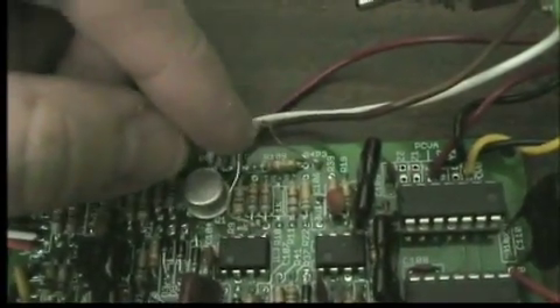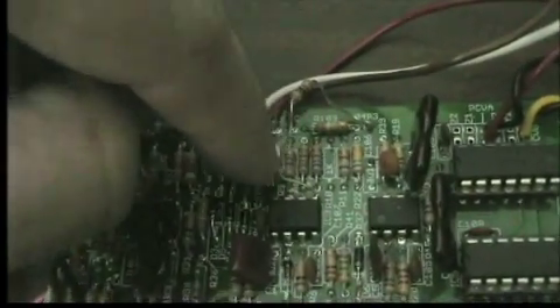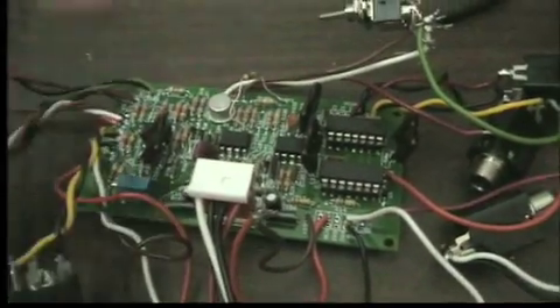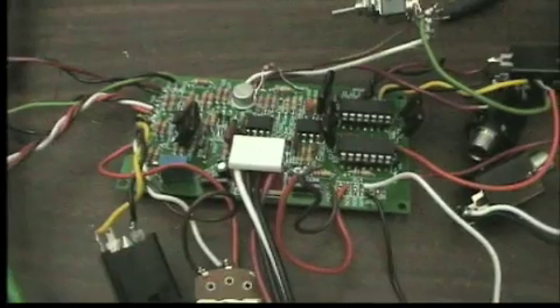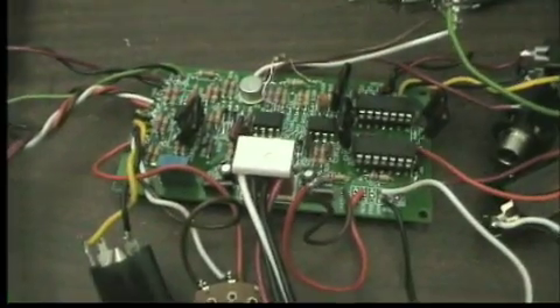I do need to make a revision of this board. There's a little resistor that was going to the wrong place, so I had to take it out and make a little jumper, which is not very elegant. There are also a couple of adjacent pins on the bottom of the board that need to jump. This is close enough that if people are comfortable making this jump they're okay. I'll probably sell this board for a couple bucks off what the revision will go for, just to get rid of the boards since people are anxious to get working on these. There's also a trimmer that controls the pulse rate — if you wanted to trim it so that some front panel setting met some exact frequency, you could twiddle that.